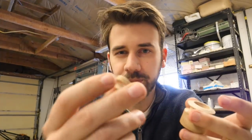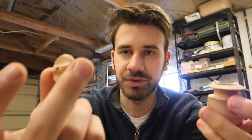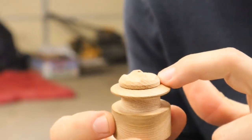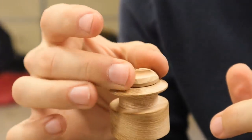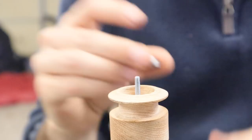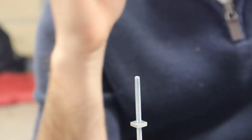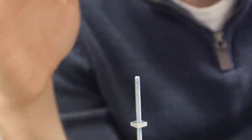I just realized something I overlooked. When the spool is giving out line and taking drag, there needs to be independence from friction on the drag knob. Otherwise the spool will just spin and unscrew the drag knob - it'll push up on the knob and unscrew it. There needs to be bearings between them to take friction away from the drag knob, so I need to think of a way to do that.